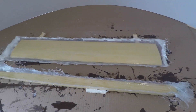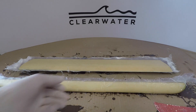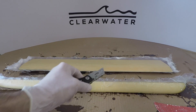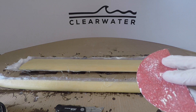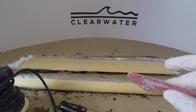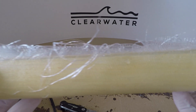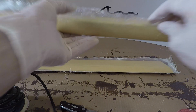The mast and fuselage are fully cured — ugly looking right now but they'll look very nice once we clean them up. Start with a utility knife to trim away what you can — be very careful not to cut yourself. Then come in with sandpaper; an orbital sander will make very quick work of this. I recommend starting around 80 grit. The whole idea is to clean this up and get down to the epoxy edge. You can see the edge right there — just slowly and methodically sand down to it.